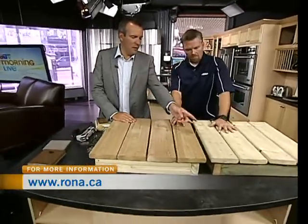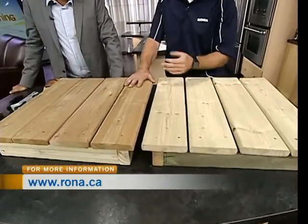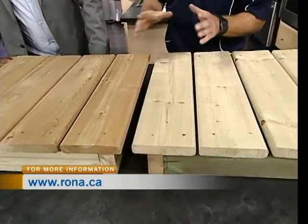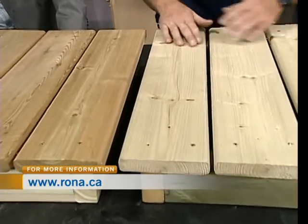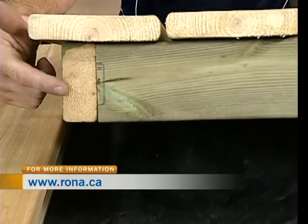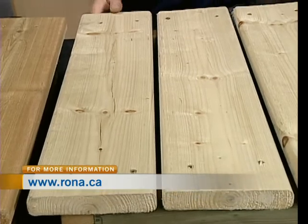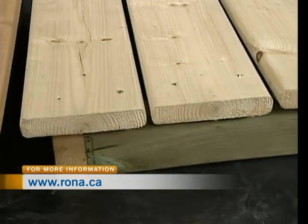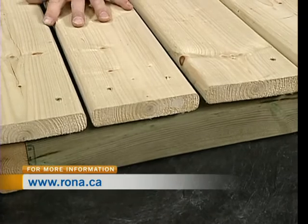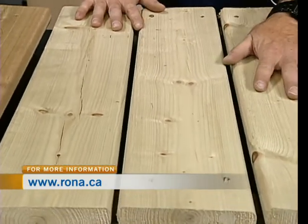It's hard for people to bite the bullet sometimes, but let's start here because this looks like raw wood. It has a slight tint to it — when you compare it to a regular untreated piece of wood you can tell the difference. It is treated — treated with carbon. You can see this is the old style where it's a bit more green, the copper-based one that everybody knows. This new pressure treated, exclusive to Rona, uses carbon instead, which is a much more environmentally favorable product.